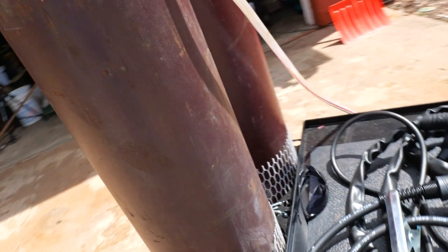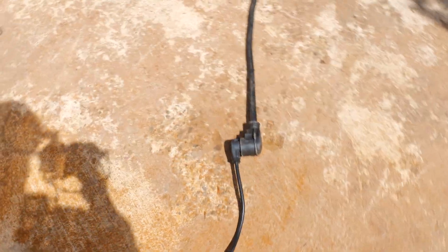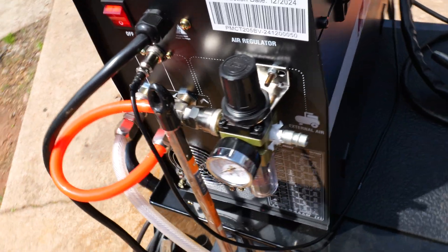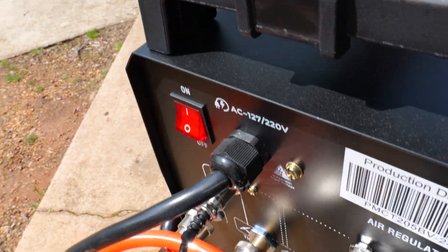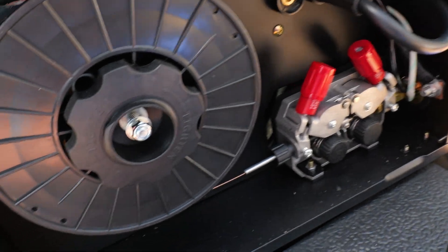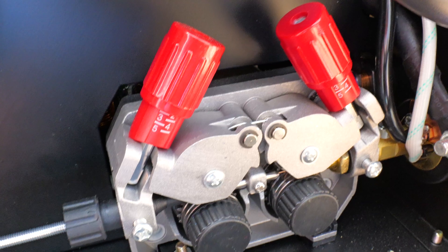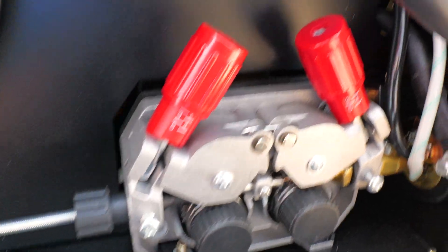Been practicing my TIG, so I think you'll be glad to see that. But we need to get this thing set up. Got it on 220 with the big old cord, 50 amp breaker — plenty of power. Here's where the air goes in for the plasma, got it all plumbed up. It uses a Euro style fitting, so I had to get it fixed up, but we got it plumbed up. Got it set up with a big old spool in there, and it's got a dual feed, which is real nice — gets a consistent pressure on that wire, really helps with the MIG welding.